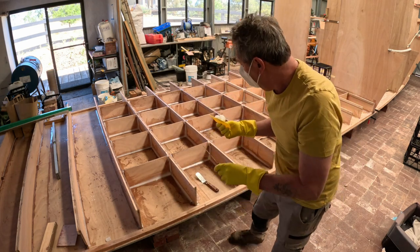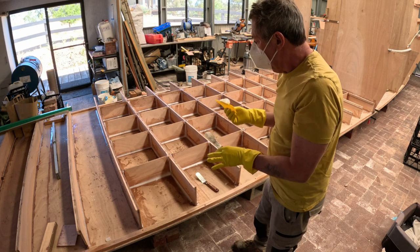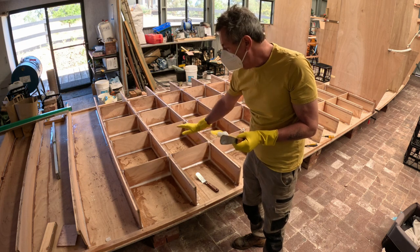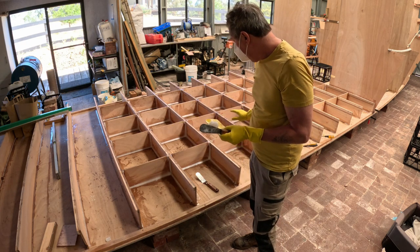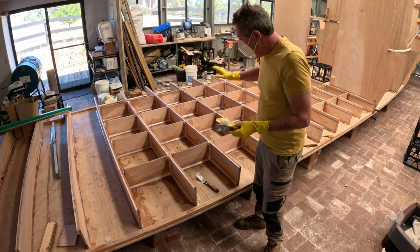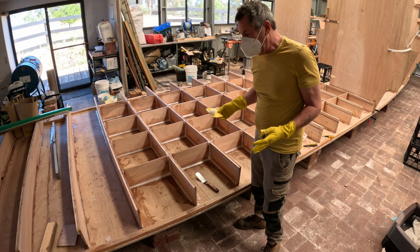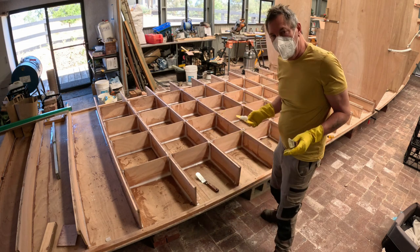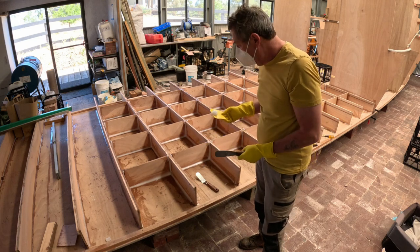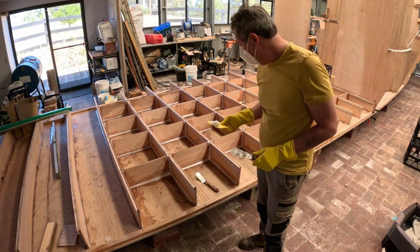Anything that I miss in these top joints here will get filled up when I'm doing the floor. So, of course, when I put the floor on, this gets the sand over the top to take off any dry glue residue, and then nice gooey fillet after wetting out along all the joins, and then the floor gets screwed down on top of that, and then it becomes an extremely strong structure. Even when I built the model, once I put this sort of framing in the model, which I did as I went along, I couldn't even bend the cardboard after I've done this honeycombing process, so I'm pretty pleased with it.